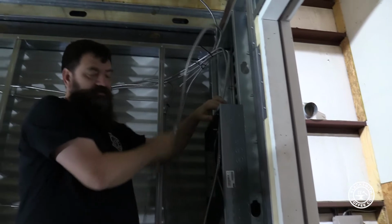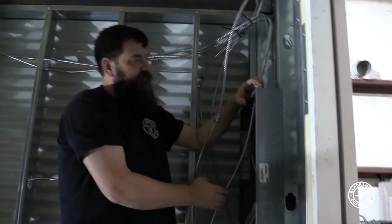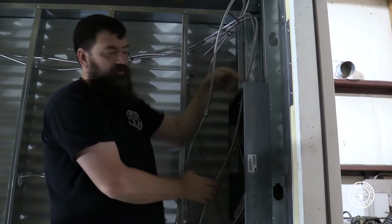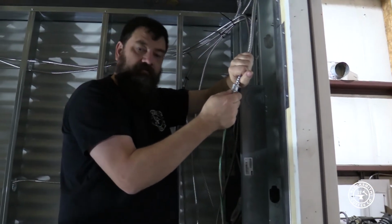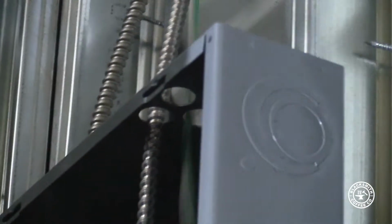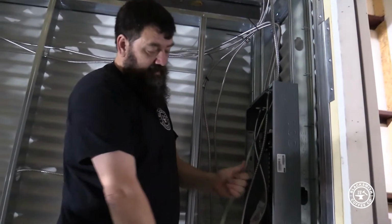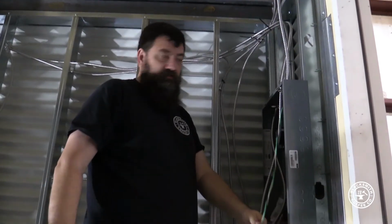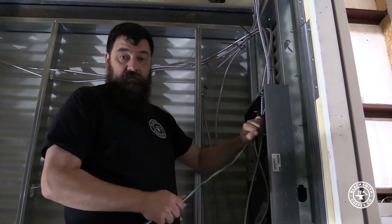So now, again, just like on the boxes, your breaker box also has holes. So I'm gonna run right through the hole, and just like this popped onto this wire, it'll now pop right into the breaker box. Catch that? I just pushed that in there. Now you can see I got my 3 wires here. This is basically one circuit complete, and this completes the rough in for the breaker box side.